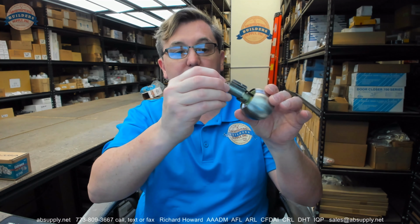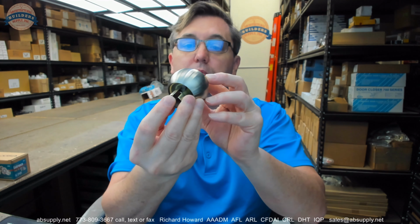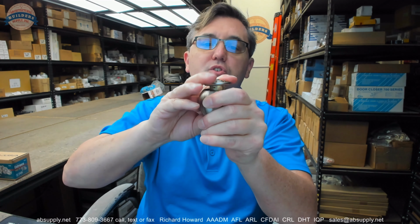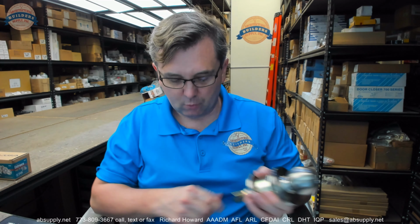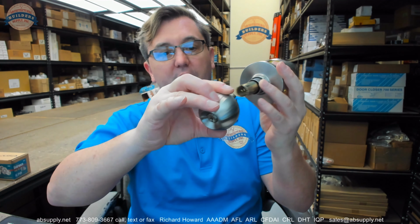So what we'll do is we'll put this back together. The cylinder goes in. You want the plug of the cylinder to fit back in the hole, otherwise you won't get the inside knob rose on. Okay, got that in there. Going to bring that back down. Just carefully seat that. When you're dealing with small tools, sharp instruments, sharp hardware, it's not unheard of to get some tool somewhere where you don't want it to go. So we'll set this back together as a right hand, just more common. I think right-hand doors dominate. There's probably 6 out of 10 doors that might be right-handed, so we'll put it back that way. Teeth are up. The retracting hub is on the side that will permit a right-hand door to work.